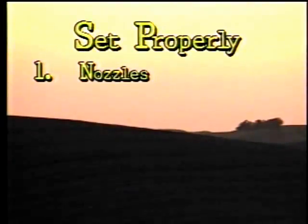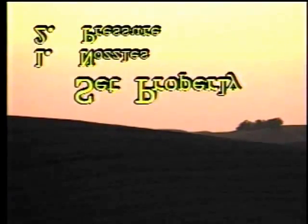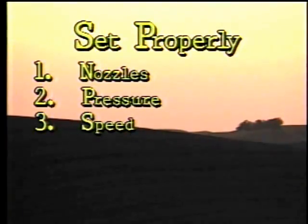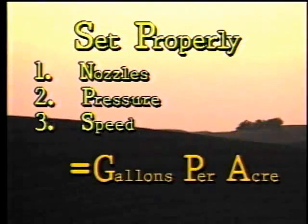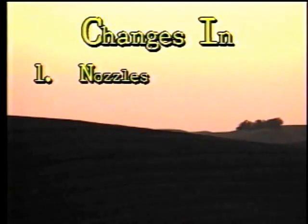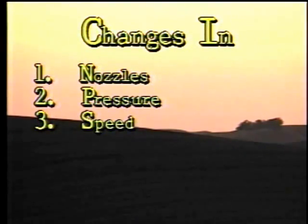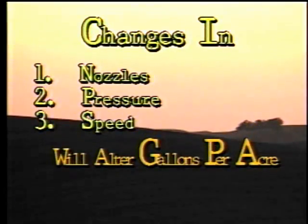Great. It's got WR3 nozzles in it. We set the pressure at 30 pounds, we know that. You're driving 4 miles an hour, and you're putting out 21.2 gallons by the book now. That meets the label requirements. You should have very little drift potential with this, but always keep in mind that any changes in speed or pressure or nozzles are going to alter the output of this sprayer. And you should monitor all this stuff on a regular basis all the time. You won't have this trouble anymore.